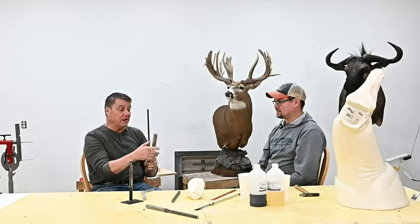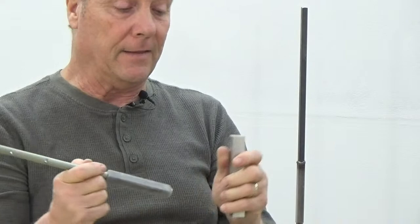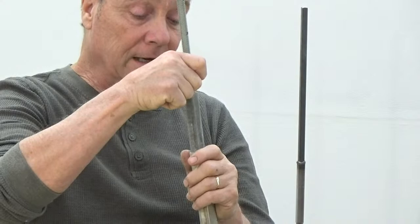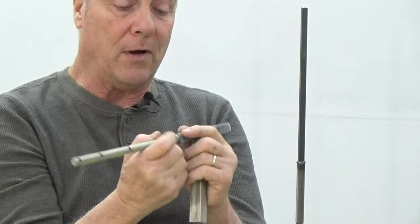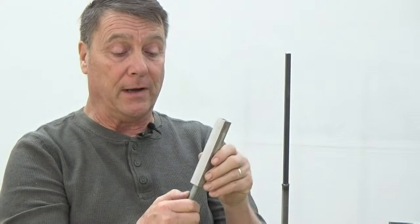And we use a lot of this stuff. That's nice stuff. That one comes with a sleeve. It's called a pedestal rod attachment, I believe. This is an aluminum sleeve with an epoxy core. I think you could make these yourself if you had nothing to do with your time. You take a threaded rod, fill this full of epoxy, slide it down in there, keeping it centered, let it set up, and then cut the top off. I wouldn't want to make one for every project, but it could be done. You just want to make sure whatever epoxy you use isn't going to bend once and fall apart. But this is a really nice attachment,